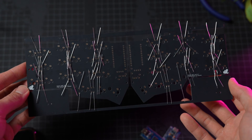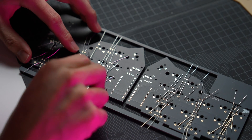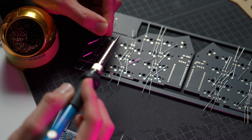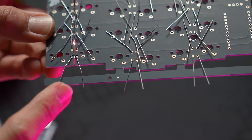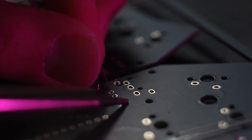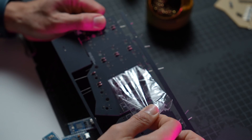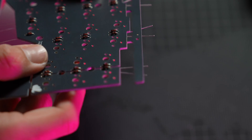After you have placed the diodes through the via hole, it should look something like this. Before we start soldering, I will be applying a layer of tape to further secure the diodes in place. Each diode has two legs, and you will need to use a soldering iron with some solder to fill up the via holes near the diodes. Simply heat up the soldering iron to about 300 degrees Celsius, place the solder near the iron, and as it starts to melt, begin filling up the hole where the diode legs are protruding. Once you have confirmed that all the via holes are soldered, remove the tape and check one more time. We need to do this for both the left and right side.